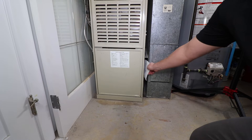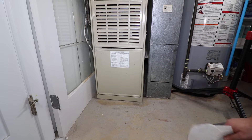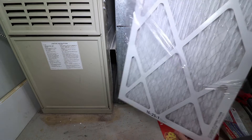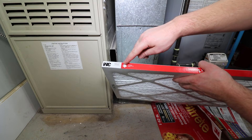If you are unsure of the direction of airflow, slide a paper towel in the filter slot while the blower is running to determine. I personally like to draw an arrow on the sheet metal to leave the guesswork out for my clients. Once you purchase the replacement filter matching your original dimensions, it can be installed by matching the direction of airflow arrows.